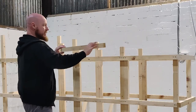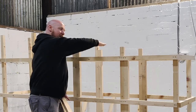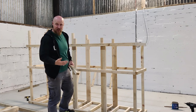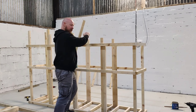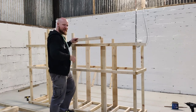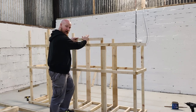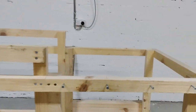There's another reason we're doing this. If we didn't have this piece of timber, your front board would come up and meet your top board, leaving a weak point at the corner - and that's where most of the pressure from the atlas stone actually goes, when someone doesn't get it quite high enough and hits that corner. With this piece of wood here, the atlas stone hits the timber sheet but it's supported behind by this piece of timber.